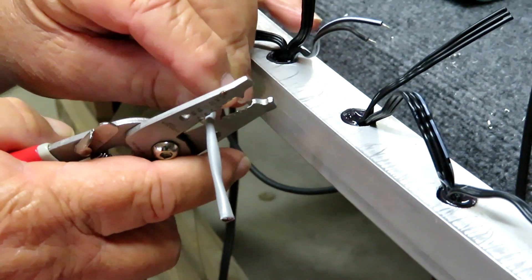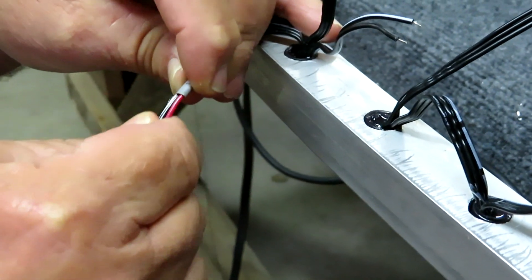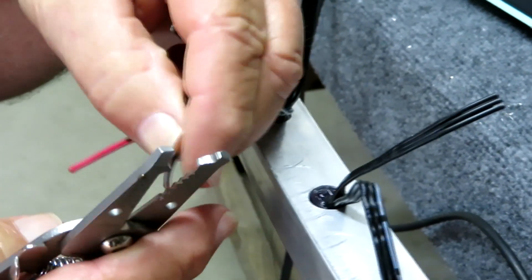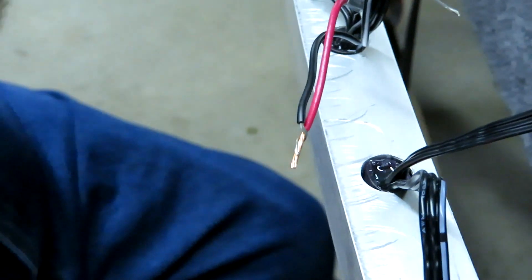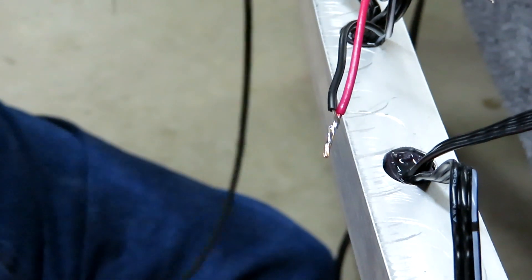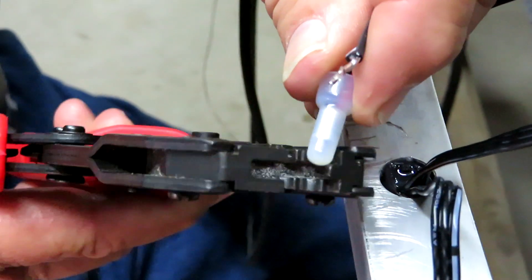Now we have to parallel the power supply because each one of the strips is 50 lights long, and you need to parallel these strips with extra electric wire — if not, there's too much current running through the small wires. I'm using a thin 18-gauge wire to parallel the B+ source at each one of the 50 junctions, hooking up the B+ for each side.